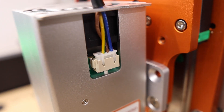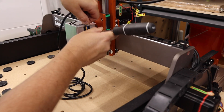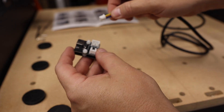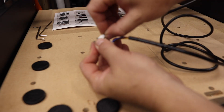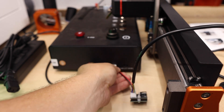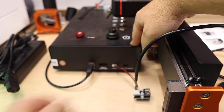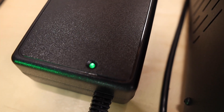Next, attach the 4-pin wire to the laser module. I used a flathead screwdriver to help pop this in place — just be careful not to force it so you don't damage the connections. The other end of this wire is a 3-pin connection. You'll need to plug this into the provided power adapter, then install the included jumper wire from the power adapter to the CNC controller. Make sure to flip the controller switch to laser and plug in the power supply to the power adapter. That's all there is to it.